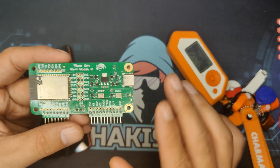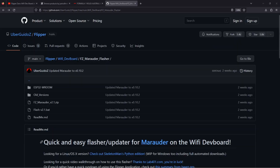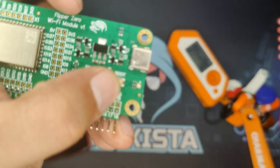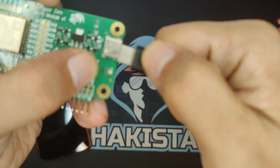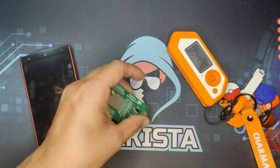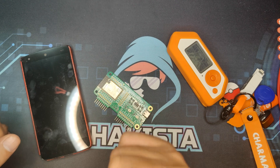You should know that the Wi-Fi module doesn't work out of the box — you need to flash the firmware first, which is really easy to do. First, download the batch file — I'll put the link down below. Put your Wi-Fi dev board into debug mode by holding the boot button while you are plugging it in, wait about 3 seconds, then run the batch file and wait for it to finish. You are now good to go.